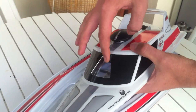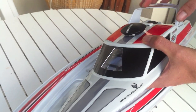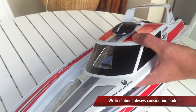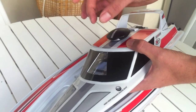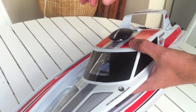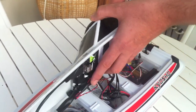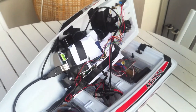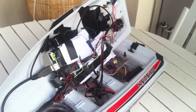The cam was the other big problem we had. Essentially nothing works, so we had to build a custom C application which reads the stream from the camera, which is in MJPEG format, cuts it up into JPEGs, and transmits those using multipart x-mixed-replace format, so that the browser can update the image.